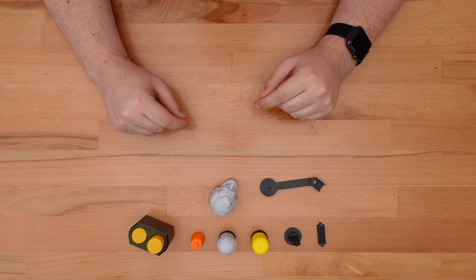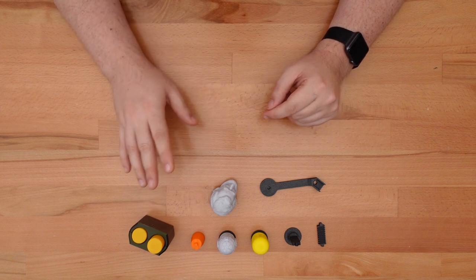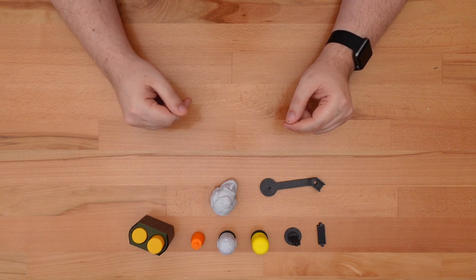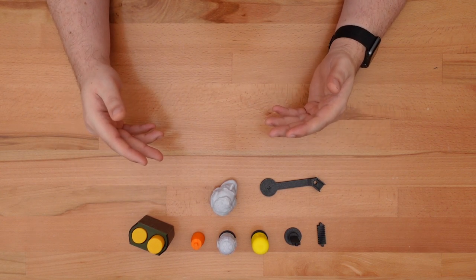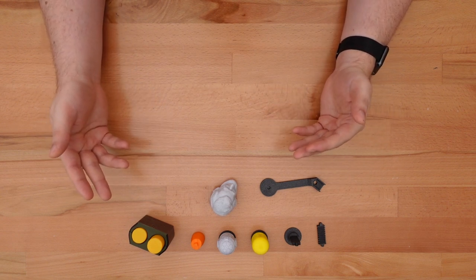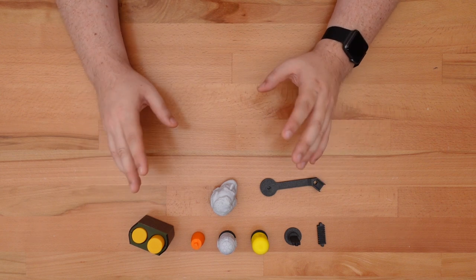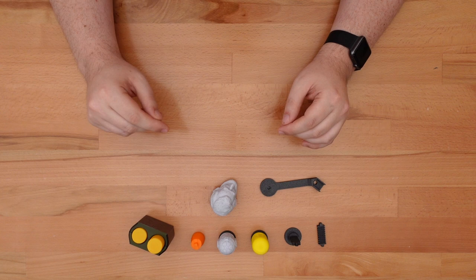As a final caveat, I've been printing with this bobblehead for a few weeks now, and I haven't noticed a change to my print quality. In theory, a small weight bouncing around on the extruder could cause problems, or, strangely enough, it could actually reduce print artifacts by acting as a damper, if you're extremely lucky. Either way, I wouldn't add this to a machine attempting crazy print speeds or requiring critical precision.